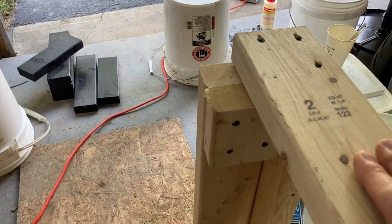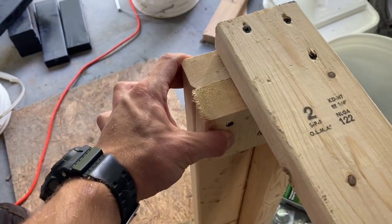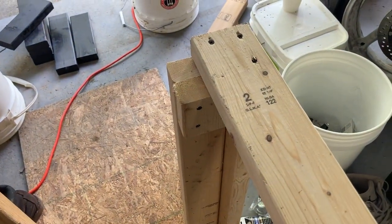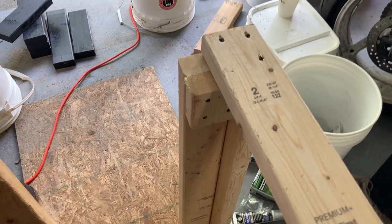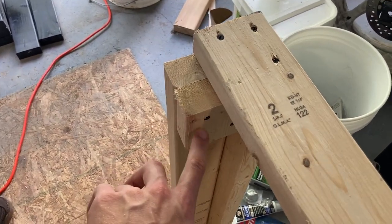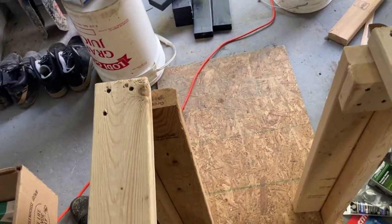I put it on a slight angle — lower left or right — so they don't intersect. The top is flush here so when that piece of wood comes across it's going to be way stronger. Honestly this thing might be able to hold water after all once we're done. I'm going to repeat that on the other three corners. If you're worried about splitting the wood, go in then back it out — that's also why I'm using drywall screws, because they can go through the wood more easily without splitting. Deck screws in my experience don't really like to be driven all the way in.